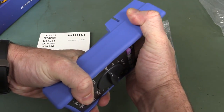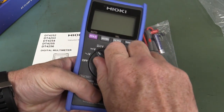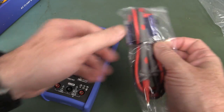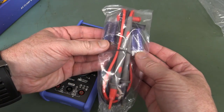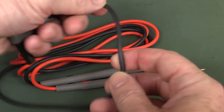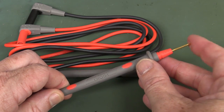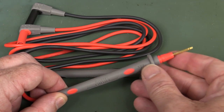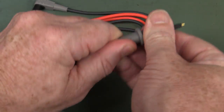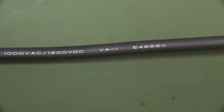Let's give it a twist test. Actually, that's not the best I've felt. Range switch feels okay — positive detents on that. Looks like we've got four AAA batteries; I'd want to get good battery life. The probes look and feel really nice — flexible silicone insulation on them. Not the sharpest tip, but it does the job. Gold-plated, Hioki-branded probes, and they do have the slip-on CAT4 guard. And Underwriters Lab listed cable.